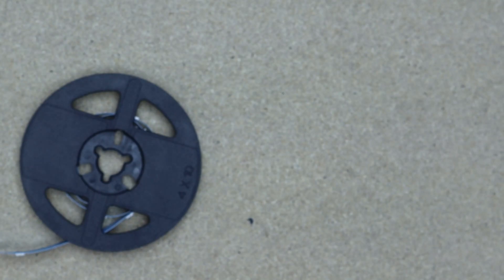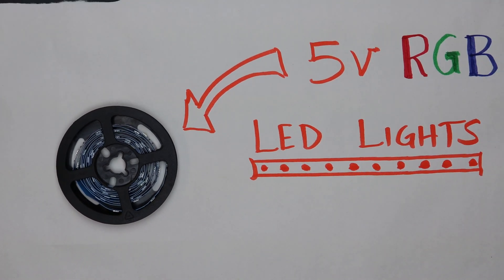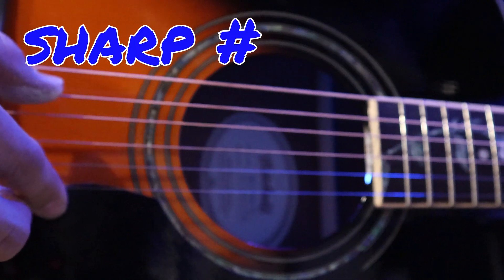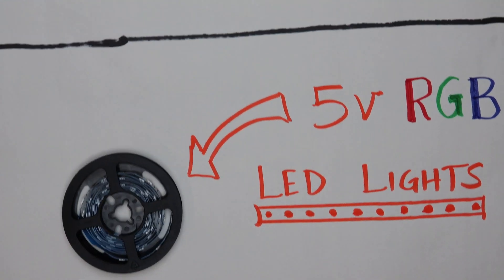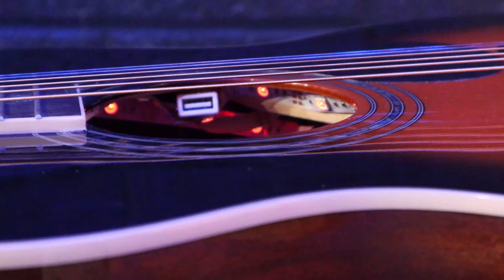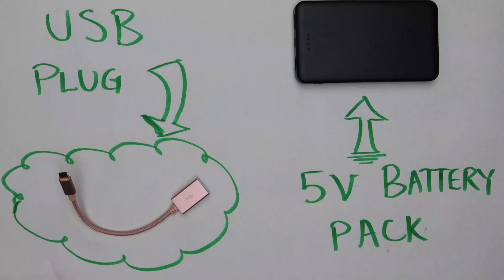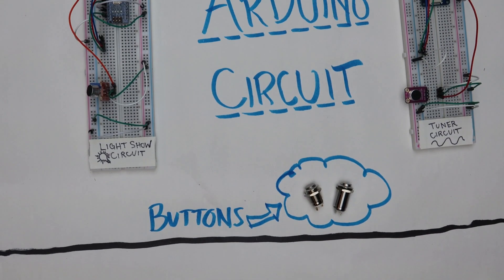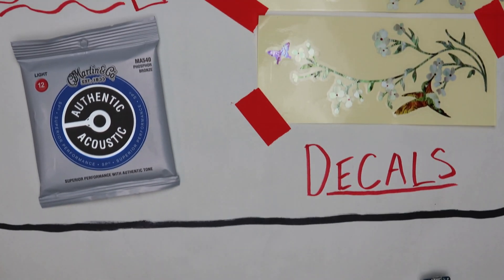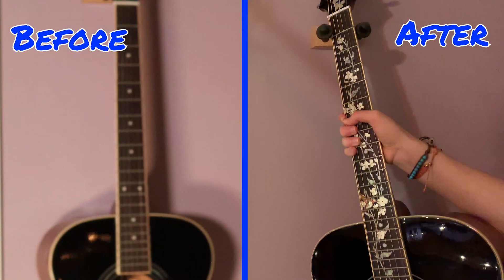The plan is to use this entire roll of LED lights to color the inside of her guitar based on whether a string is flat, sharp, or in tune. For this to not ruin her guitar, it needs to be easily rechargeable. I used a 5-volt external phone charging pack with USB plug-in. The brains for the tuner come from a custom Arduino circuit, and to maximize the color, I added metallic decals and brand new strings.